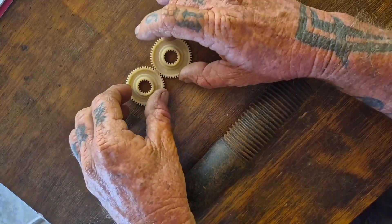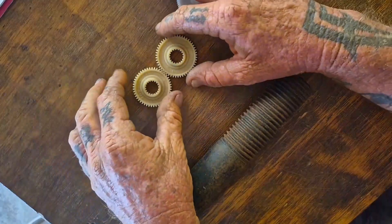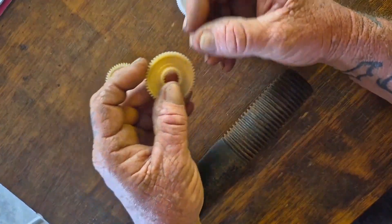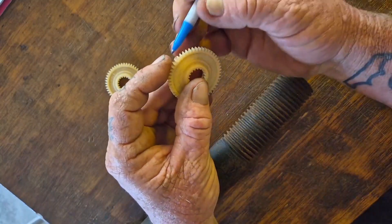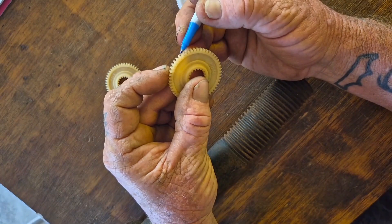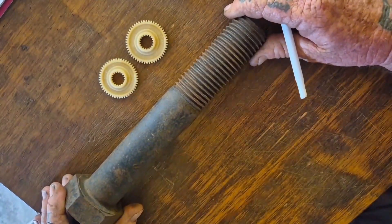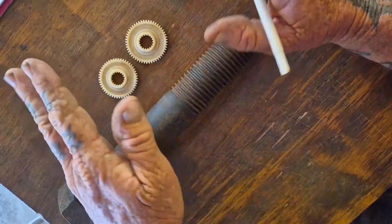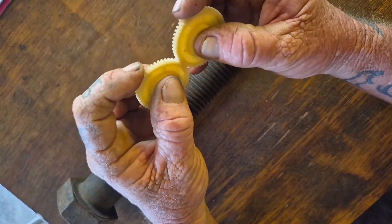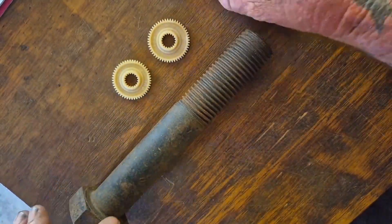It's just one simple formula. You do have to do a little bit of math, but it's simple math — if I can do it, anybody can. First of all, what is pitch? Quite simply, the pitch is the distance between the centre line of two of the teeth in your gear. Think about a bolt — I've got a rather large bolt here. We're only going to be talking about metric gears in this video, simply because I don't have any imperial gears to measure.